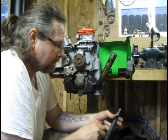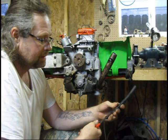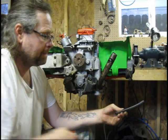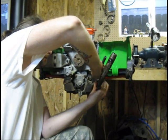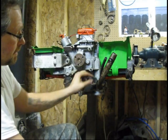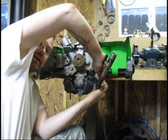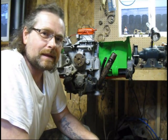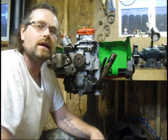What I'm going to do is take a little bit of fuel line — this is 3/8ths. I'm just going to stretch it out like so, put this over here, then cut it to length and still get a good seal. I'm going to clamp it on the bottom and on the top. It's kind of a homegrown way to do something, but when you're on a shoestring budget and you still need to get the job done, you got to do what you got to do.